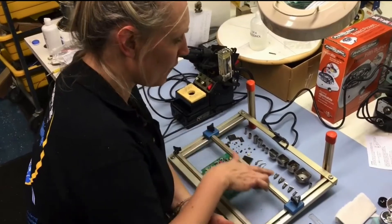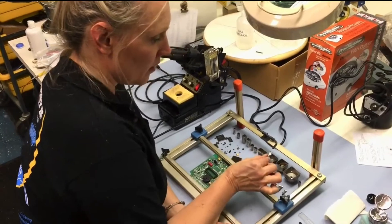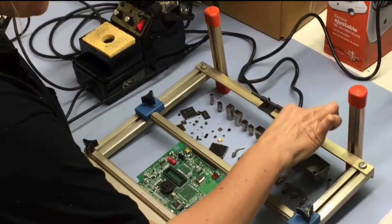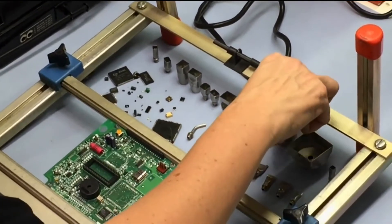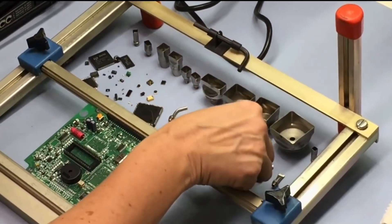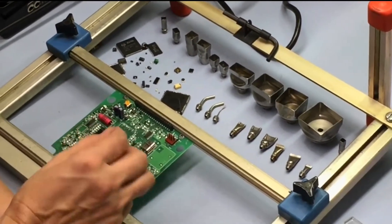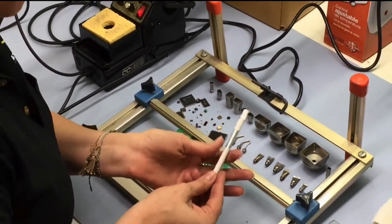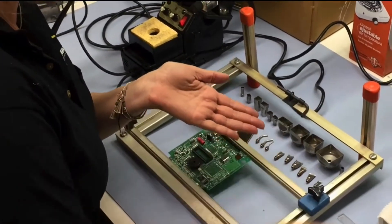I was able to use quite a few of the different tips that Edson makes. We used the dual flow tip to remove one of the packages where the air was able to flow on both sides. We had the quadra flow tip where we were able to remove one component all at the same time. We also had the fan tip, used against one side of a component to reflow the whole area and then remove it from both sides. We used our shim tool, which is my favorite little tool, to remove quite a few of the packages. Edson also sells tweezers and things like that if you prefer that method.